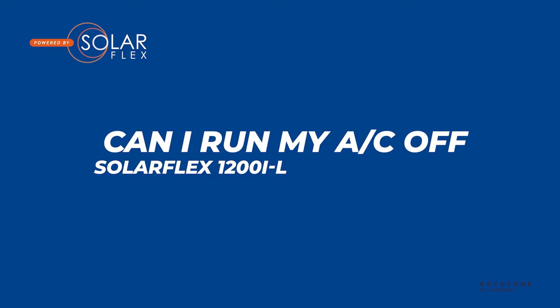Can I run my ACs off of the solar? You can actually run them both, but you're not really running them off the solar — that's a common misconception. You're not really running anything off of the solar panels. You need three components in a good system: you need a battery bank, which think of it like a fuel tank; you need an inverter capable of running those items; and then you need solar power. The solar panels up on the roof are like a pump at a filling station — they're putting the energy into the battery bank. The battery bank is hopefully full and topped off, and the inverter takes the energy out and runs your coach. You've got 25 amps of power available through the inverter, so yes, you can actually run both air conditioners at the same time off your battery bank.